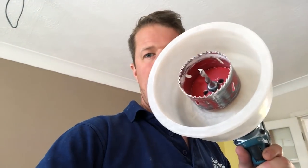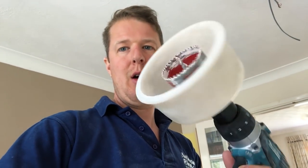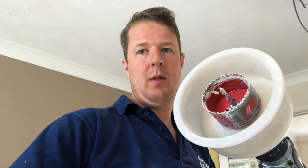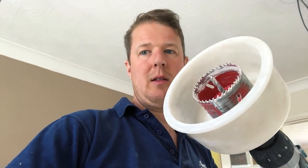While I'm doing a bit of drilling, I thought I'd talk to you about the DADE, which stands for Dust and Debris Extractor. It's this plastic thing here - basically a rubber sleeve that goes over your hole cutter. Its simple but important function is to catch all the dust that comes down. So I'm going to drill the hole and then it catches the dust.